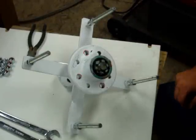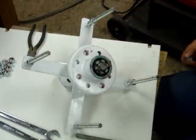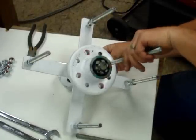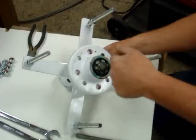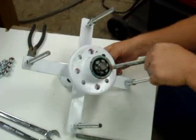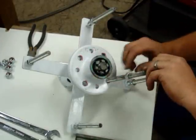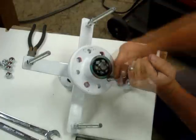We're going to make it right in that grease cap. Let's start off right here. We've already cut these to the right length. Slap these in. I tighten this all the way down and then back it off a quarter turn. There, nuts full. That's a good idea. I bring it up about two, three nuts length up.